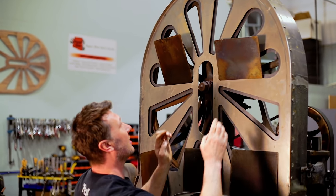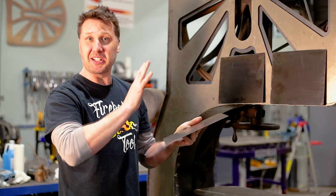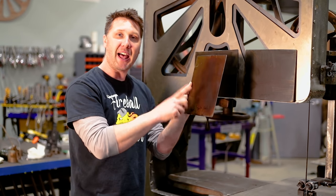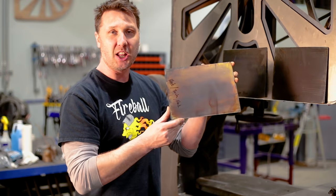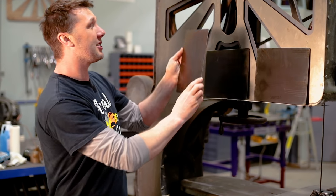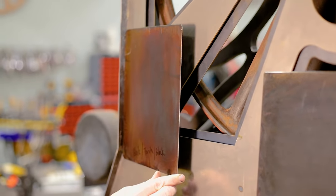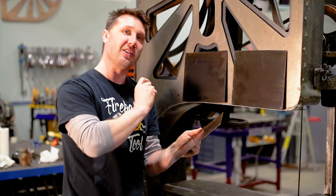Take a look at how cool all these samples are. I'm so glad I took this extra time to develop this little collection of patinas. After careful consideration, I think my favorite coupon out of all of them is black with torch and black applied again with a satin finish over the top. I just applied it with a Krylon spray. I really like the elements of depth by adding a couple of different patinas into the same coupon, and I think it's just going to look killer on the machine. It's going to keep that old-timey look but still add a finish so it's not just plain Jane metal.